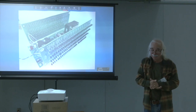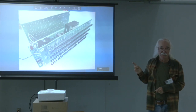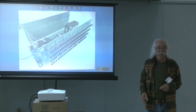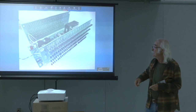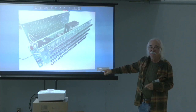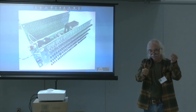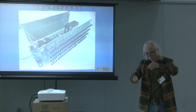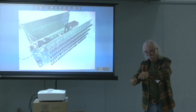Those of you who want to be very ambitious can tackle such a thing because there's no magic about it. However, you've got to get with it for soldering hundreds of transistors. And not only that, but they've got to be all neatly arranged and lined up. So I developed a technique where I tack it with the solder that I'm soldering, then position the FET, and then I take the iron away. If you do that, you can do about one every 4 seconds.